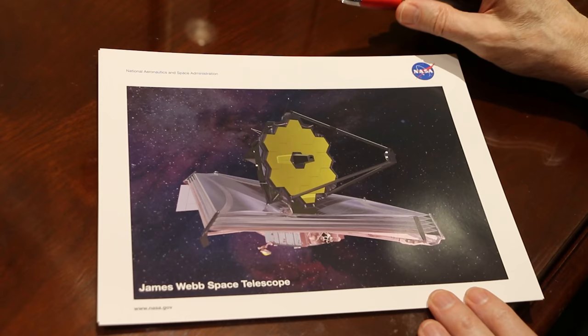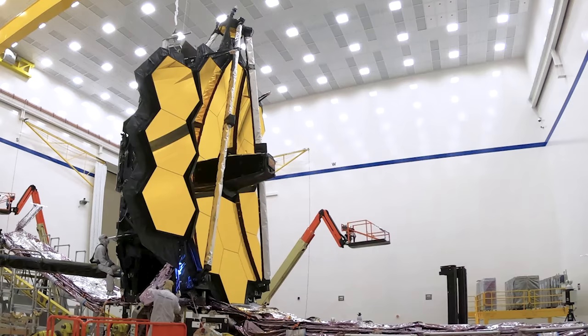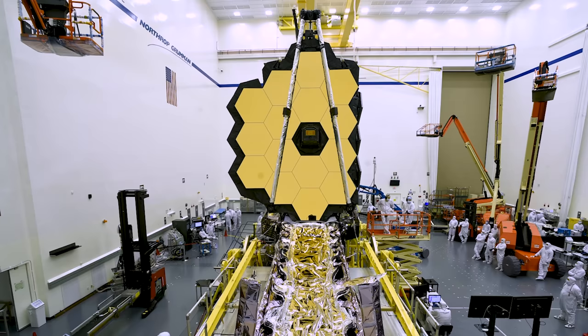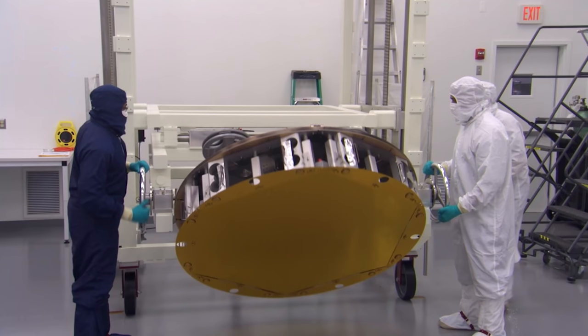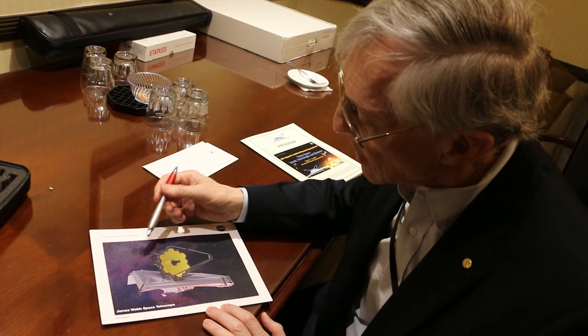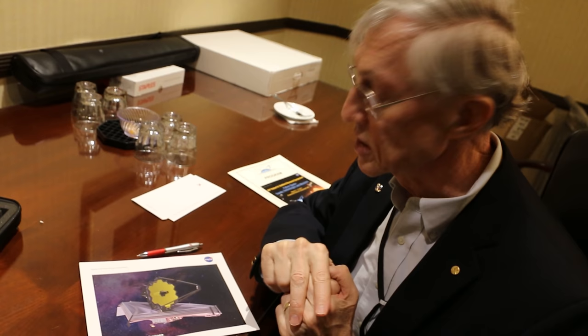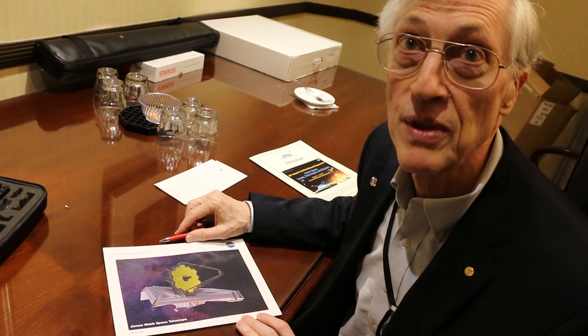The hardest thing to build was the giant mirror, made out of 18 pieces that all have to be adjusted to the right position once in space. Each piece is made out of beryllium, which is very light, very stiff, and holds its shape when cold. The challenge was learning to make them ultra-light — each hexagon is something you'd be able to lift with your hands. They're really thin material and really, really accurate. Behind the telescope mirrors is the instrument package with cameras and spectrometers. They needed much better detectors — made of two types: mercury cadmium telluride, and arsenic-doped silicon — giving sensitivity across the full wavelength range they wanted to study.